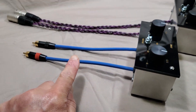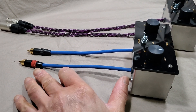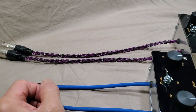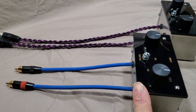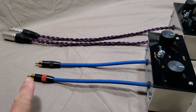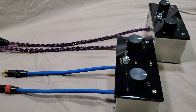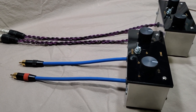At the output, the cable is kept as short as possible. Standard length is 6 inches — really that's 6 or 7 inches — but I can do as long as needed. The shorter the cable between the attenuator and the input of the power amp, the better. This one is optionally 12 inches. If your installation allows it, it is better to be as short as possible.